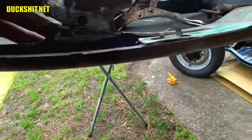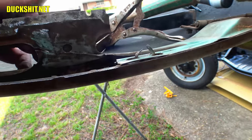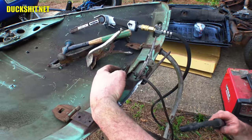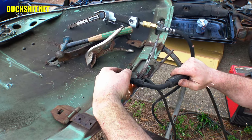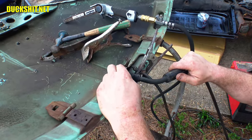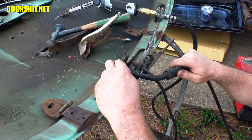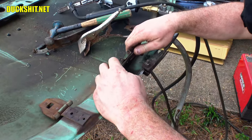You can see at the bottom where there was one spot weld that cracked along. I'm gonna get some welds started there in the middle and then work my way out, then gradually start bending this corner and that corner into place so those gaps close up. I've got the welder dialed back as far as it'll go. I'm gonna try to just get a couple of tacks on here. I had my finger on the back side of it — damn idiot. I think that's gonna work. Yeah, that's gonna work.